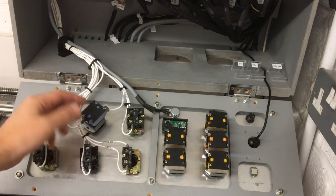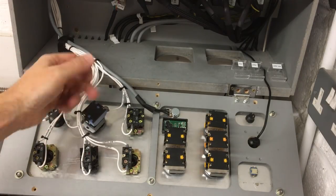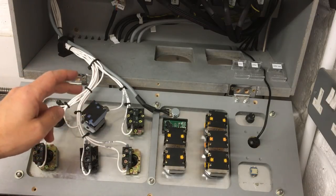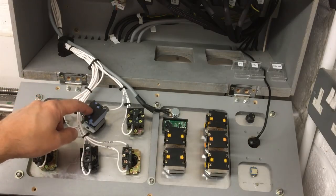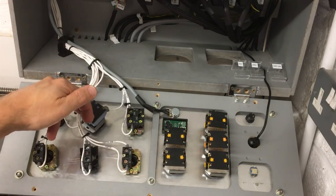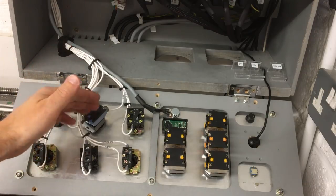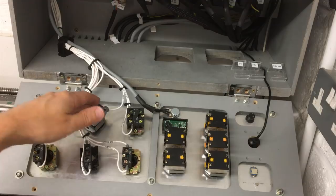This one's the reset switch, so this is a temporary switch in here. It's a momentary one, so you press it, it makes the contacts, and when you let go then it breaks. Just does that momentary reset. Now I've got one on order, because this is just a placeholder if you like. It's illuminated, so there'll be another pair of wires that comes down, feed 24 volts into that, so it'll light up, then when you press reset and the system's active, the light will go out. It's a red light on there.